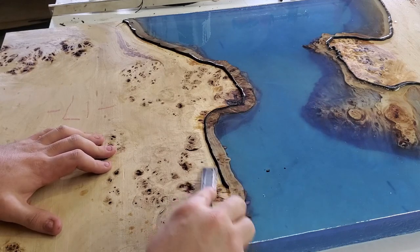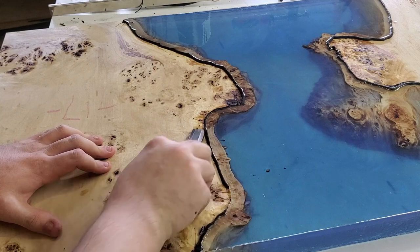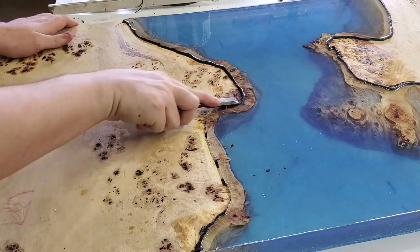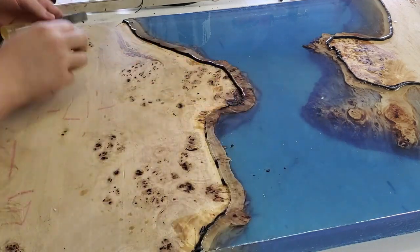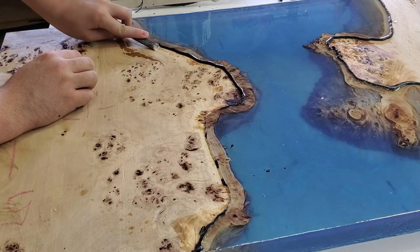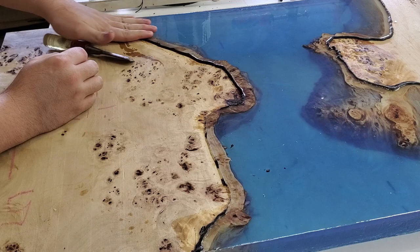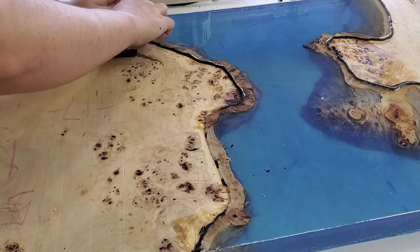When you're overfilling your molds to avoid pouring twice and to save epoxy, you run a little bead of silicone around so it acts like a dam. You can see me scraping it off — you don't have to if you're flattening yourself with a router sled, but if you're bringing it to another company to run through their planer it's just nice to take it off so you're not jamming their machine.